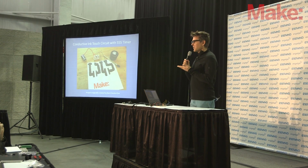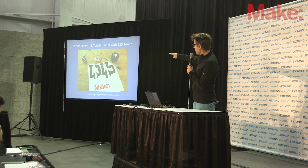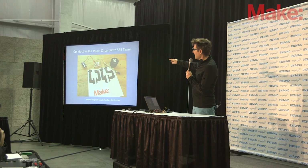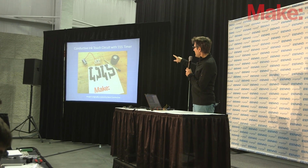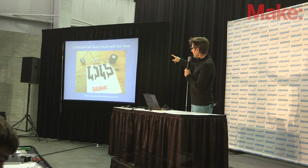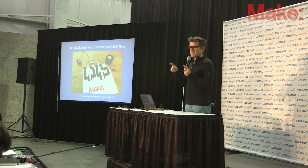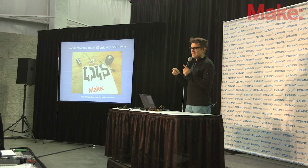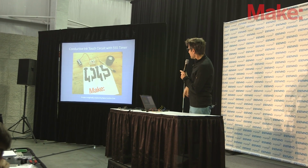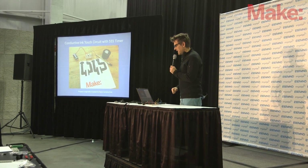We're going to make a circuit using a solderless breadboard and attach paper clips to a piece of paper that has this conductive ink, bare conductive ink. It allows you to draw part of your circuit on this paper with this material, and the electricity can conduct through it. The circuit we're building allows your body to actually be part of the circuit, so that when you put your fingers across those little gaps, you can complete the circuit and control the LED, the way it blinks and stuff like that.